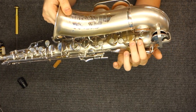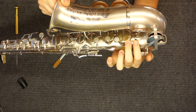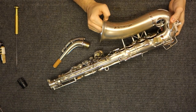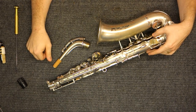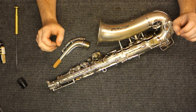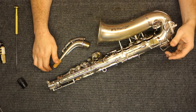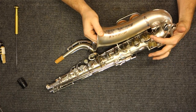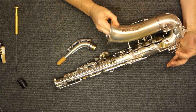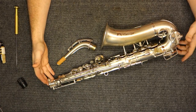You'll notice there's some wear here, and it looks like the silver is flaking rather than wearing off as you might expect. That's actually a result of the fact that Keilwerth used to plate silver directly to brass. What you're supposed to do is give the brass a quick copper flash — a very light plating of copper before you do the silver — because silver sticks to copper better than brass. And this is how silver plated directly to brass will wear: you'll get some normal wear and you'll get some flaking. That's just what happens over time, and it doesn't mean anything bad has happened to the instrument.